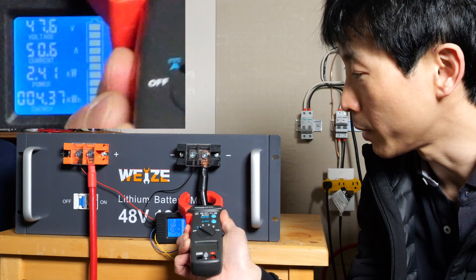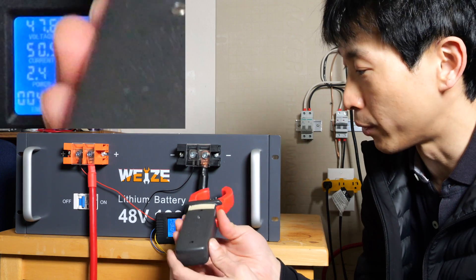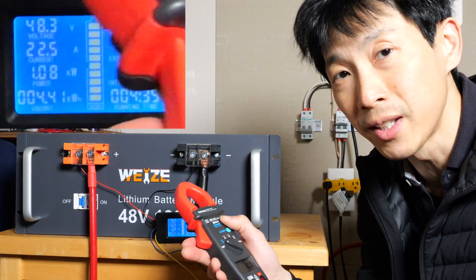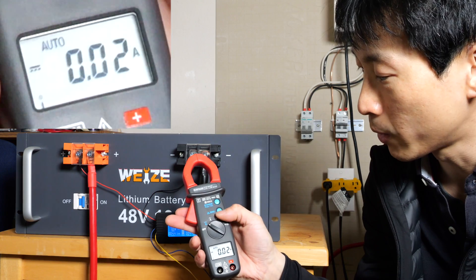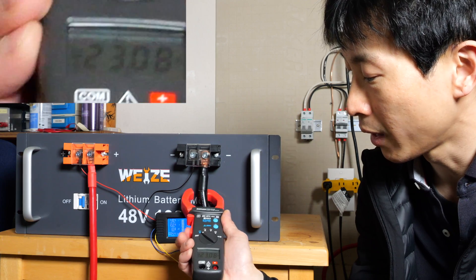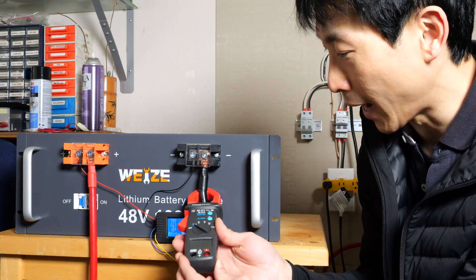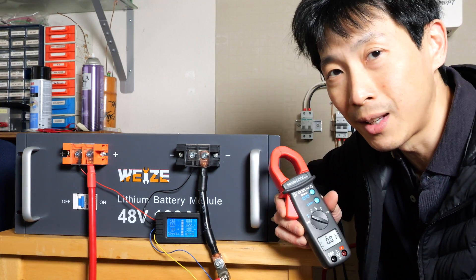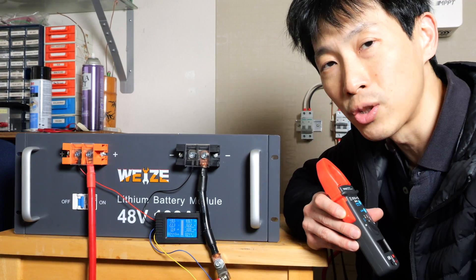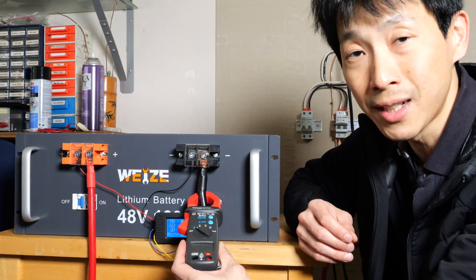I'm drawing about 55 amps out of a battery. With it set on the 400 amp range, it reads 52.1, and flipping it over gives 52.3. Turning one off to use the more sensitive 40 amp range, zeroing it out, it reads 23.08; flipping it over gives 23.18 — it actually differs slightly depending on the angle. This shows how convenient the clamp is: you don't have to connect a shunt resistor to measure current. Just put the clamp on anytime, with no added resistance and no wasted energy.